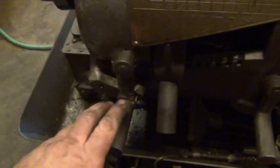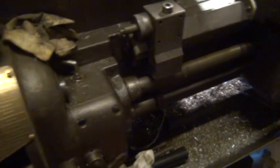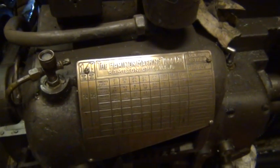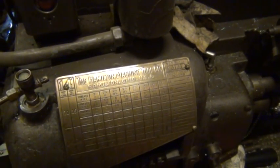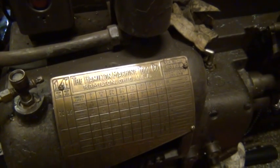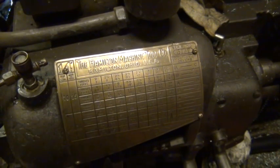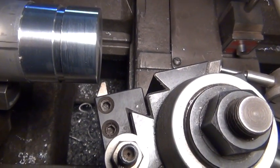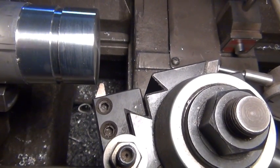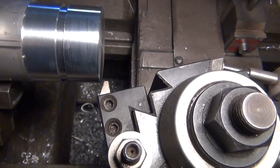You set your lever in this column for two threads per inch, and then A and C — which we've got A here and C here — and the slow speed, and that'll give us two threads per inch. The actual thread in the piece is four threads per inch, but it's a double start thread, so you have to cut your first cut at two threads per inch, then rotate 180 degrees off, and cut the next set of threads in between the first ones, which will end up giving you four threads per inch. It's a high speed steel tool bit that I ground at the right angle, while we're doing an Acme thread on this piece.